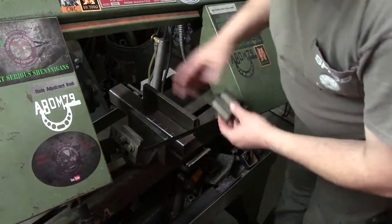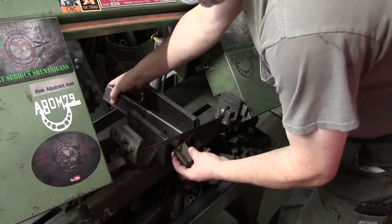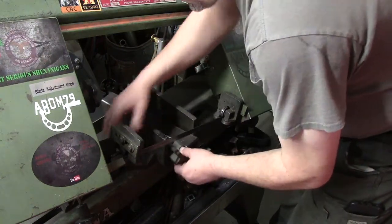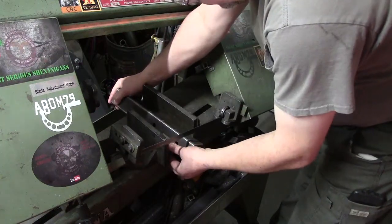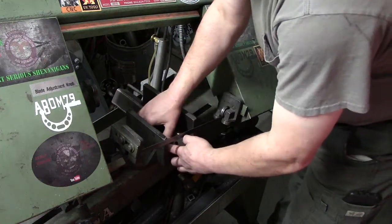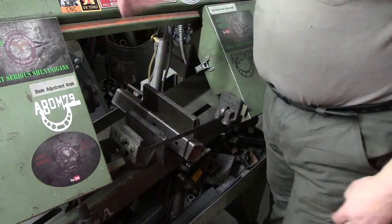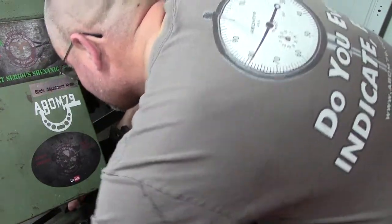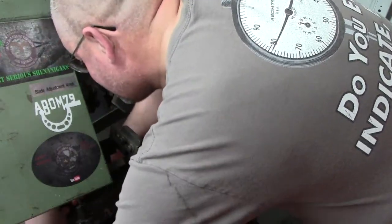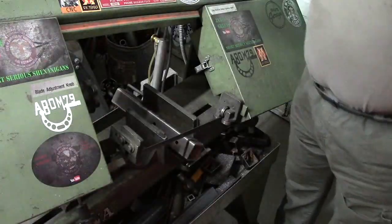Go ahead and raise it up and reset. I'm gonna put the V-block — or angle block, whatever you want to call it — in. All you do is turn it 90 degrees, slide it back a little more. There we go. Now we're going to slide it out. You want to have this V-block centered right in line with what you're pushing with.